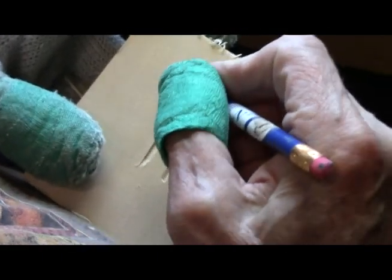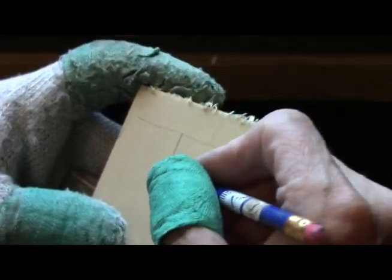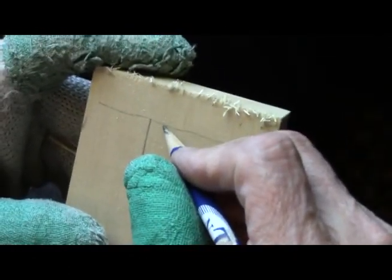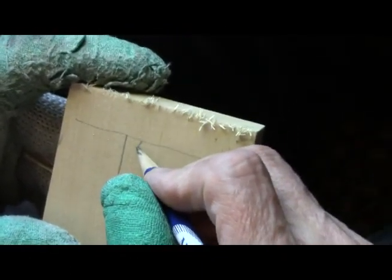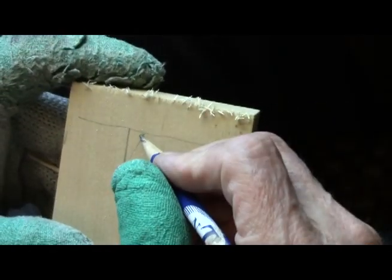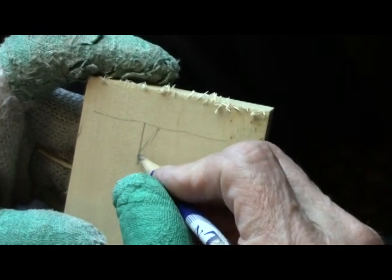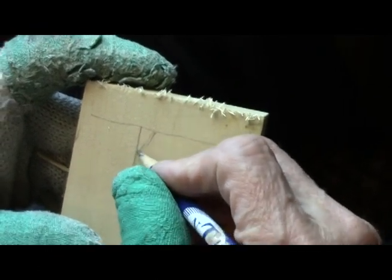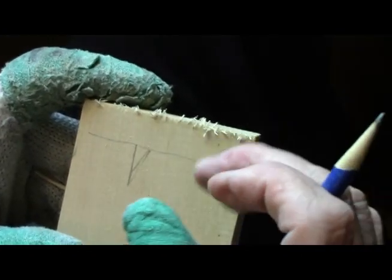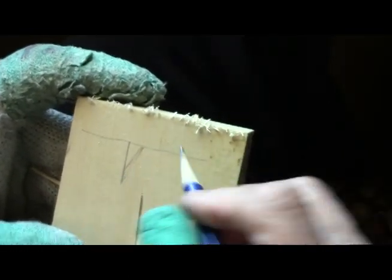When you cut straight in like that, again, this is the surface of the wood here, and then you take a piece out on the other side, it's hard to get it to match perfectly to the bottom of that cut. You're going to leave an area back in here. Now, I wet my pieces when I paint them, so if I did that, the wood would be wet, it's going to swell and it's going to close up that area right there.